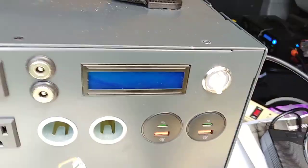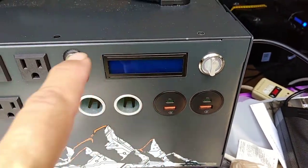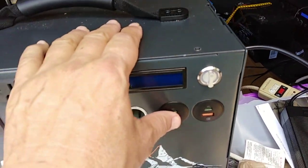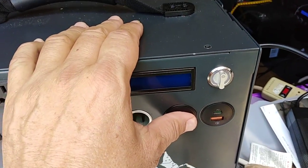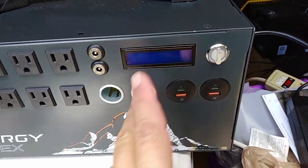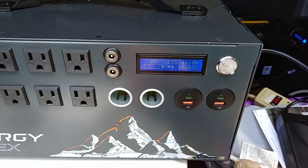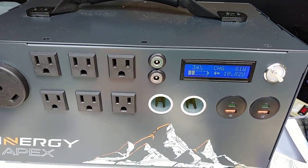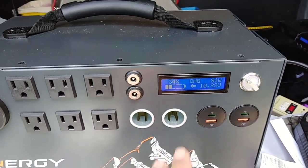I think this is another manufacturing or wiring error. I would say this Apex was very poorly assembled, or maybe sabotaged during assembly, because it shouldn't have this error. On the DC side, it's seeing 81 volts because the inverter isn't running, but it is charging.